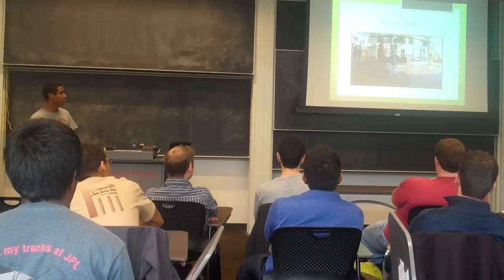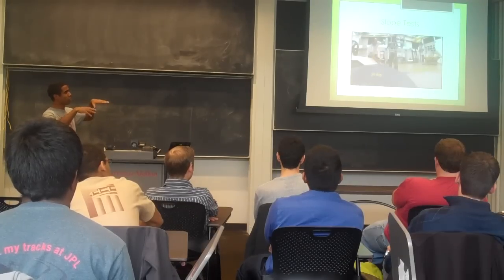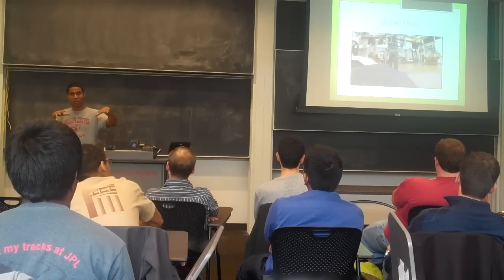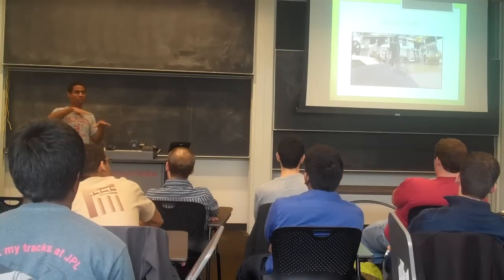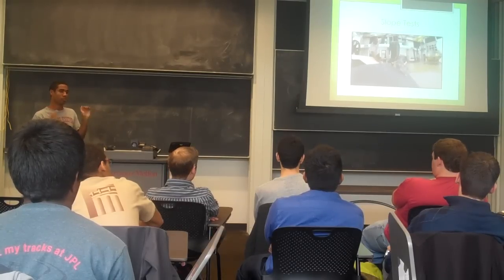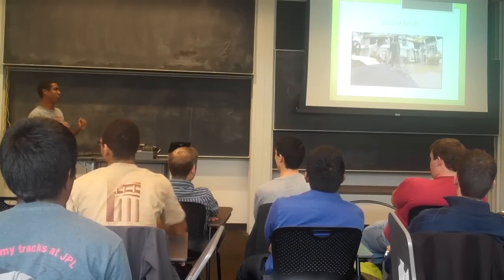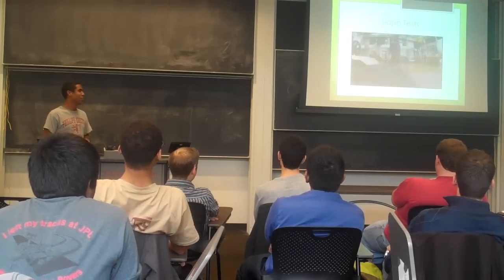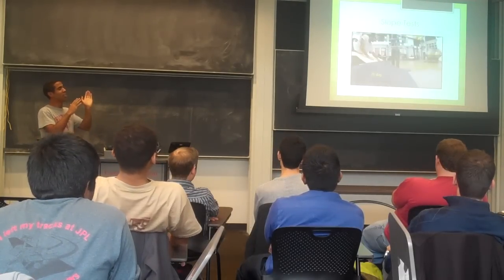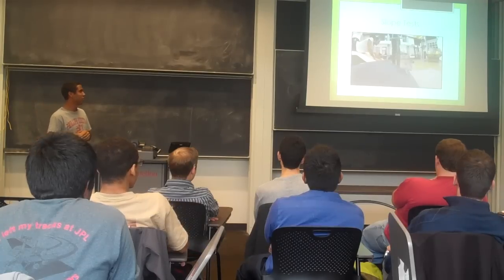So in fact, the 1-2-1 configuration of the legs is more stable than the four-legged landing vertically and straight on the same slope. So that was the surprise. This is 24 degrees. We want it to just barely not tip over. And then at 25 degrees, it'll do the same thing, except it'll hit the critical moment and tip over. Right, so.